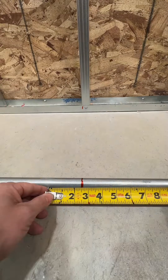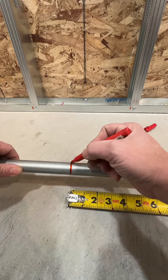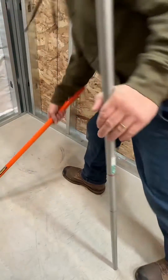How do you get the mark from center to each side? It's going to be 2-1/2 inches per inch. We need 3 inches, so 2-1/2 times 3 is 7-1/2. Make that mark on both sides of the center bend.